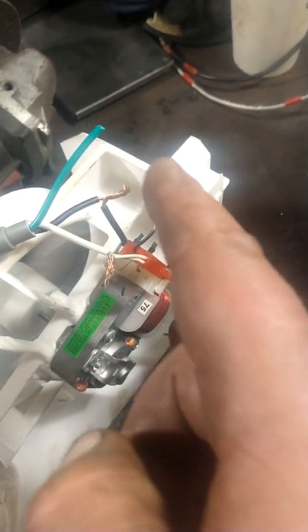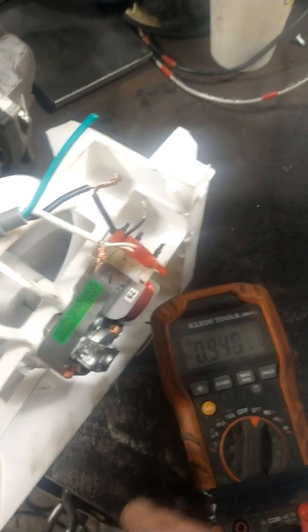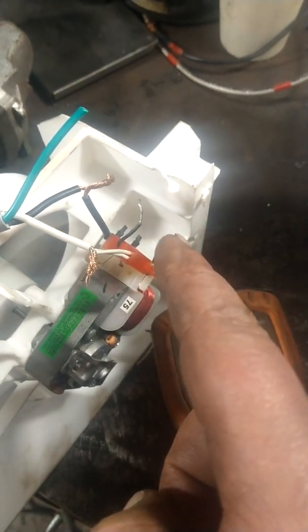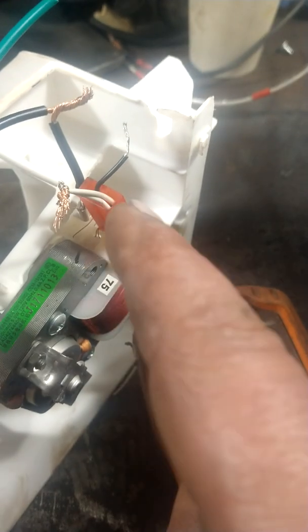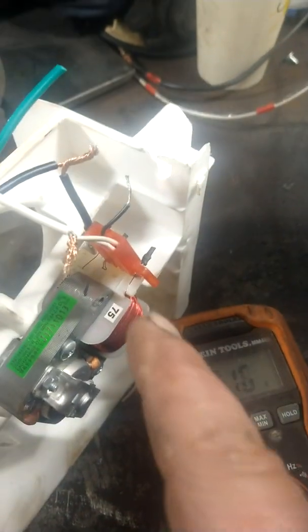I would guess that they have their main winding here — 120 volts across these two right here. So this is neutral and there's my hot, 120 volts if you measure across those two. But if you measure across this neutral and this conductor in the middle, it's a completely separate winding. There are two little wires coming up for that conductor in the middle, and that's a separate winding that's generating voltage.